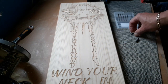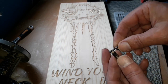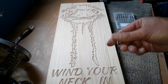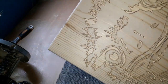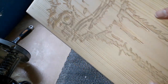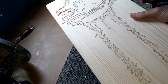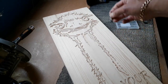I actually ordered these by mistake, but the more I'm using them the more I'm liking them. Same size shaft as your CNC bit, so you can use the same collet and literally just slot in the same way — that will fit your router again. So we'll start using this to remove the smaller bits. I've already took so many out and this is coming out quite easy; I would have been quite happy to do it all with this CNC bit. As you can see, I've done most of the lettering already, but we're going to go in with our little mill end bits just to tidy it up. Let's get this one in the router and start clearing this out.